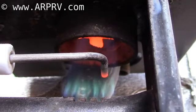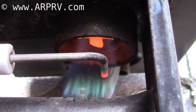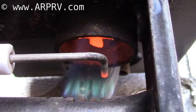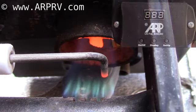It is very difficult to just look at the flame and know if enough heat is being put into the system. For example, butane has fewer BTUs than propane. Butane results in a cooler flame and sometimes results in poor cooling in the fridge. For this reason, a visual inspection of the flame is important.